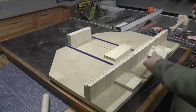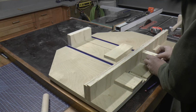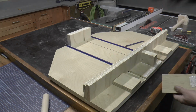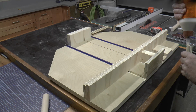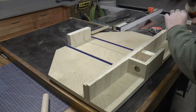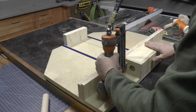Start with a 2x4 blade plug by gluing it and centering it on the cut line. Next, the back wall can be glued to the sled deck as well as the blade block. From there, glue the 2 side supports into the miter slots and finally glue and set the top plate on. For this step, you can use screws or brad nails to secure the box together.